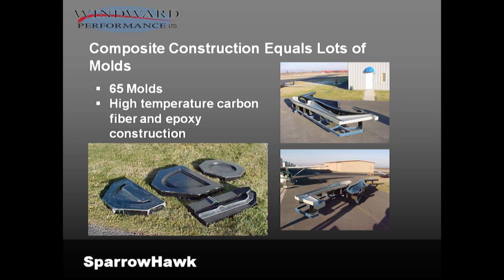I'm a stickler for jigs. People always ask if I learned this somewhere else — no, this is just what I feel is right. Our processes, molds, jigs, and fixtures are really more accurate than any place I've ever worked; I place a great premium on it, and they do come with a great cost. When you make a metal airplane, the same press can form multiple parts, the same CNC punch machine works on many parts. But when we make a composite airplane like this and go to the trouble of making molds for every single piece to achieve the greatest strength-to-weight ratio, we suffer a great tooling burden. Every part has a mold, that mold came from a plug — we make the plane about four times: the plug, then the molds, then the jigs, then the parts, then we put them together.